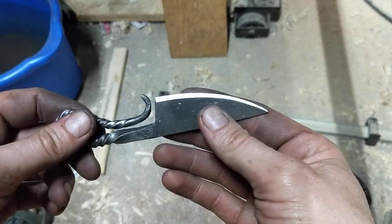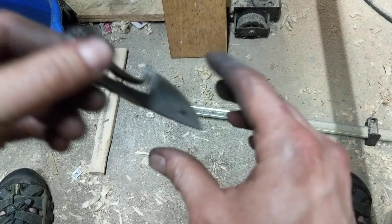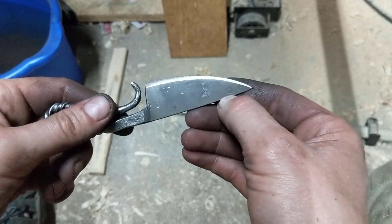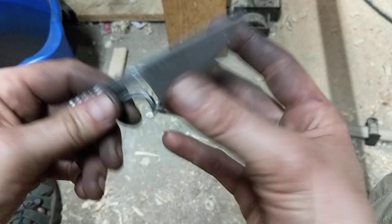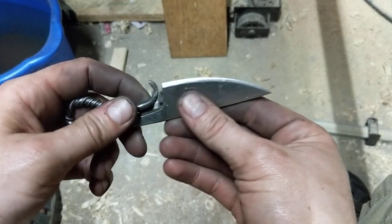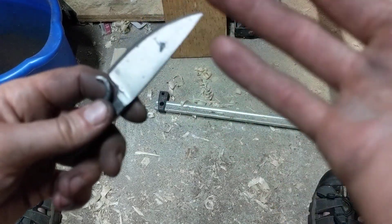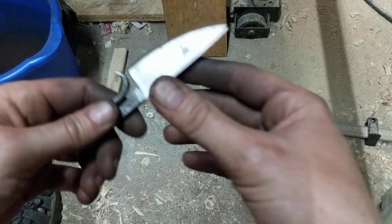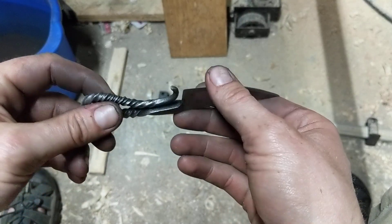I have a piece of one-inch square steel tube, and the knife and punch fit in there on the diagonal. I got a bunch of crushed-up pine charcoal. I welded a bottom on the section of square tube — probably six or seven inches long — put about an inch to an inch and a half of charcoal in the bottom, dropped in the knife and the punch, then continued filling it all the way up, knocking the sides of the can so it settled into the voids and packed the charcoal in tight. Once it was good and full, I welded a lid onto the canister.